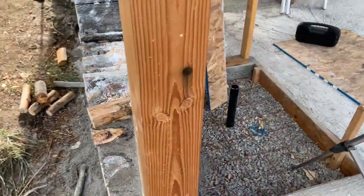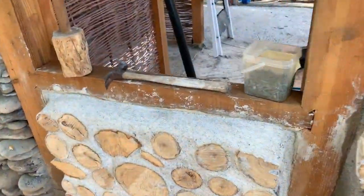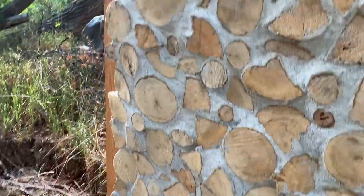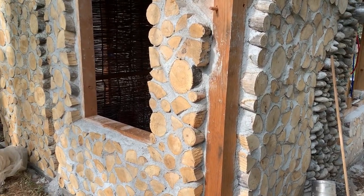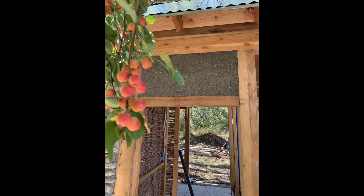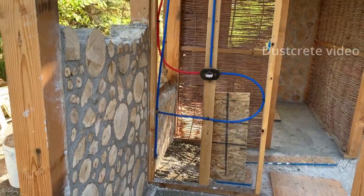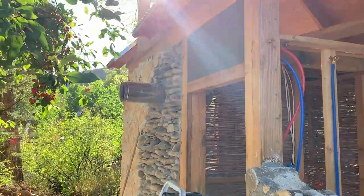There is what we got — all pretty nifty. As your mortar cures up, if you have areas that may be exposed to weather, you definitely want to make sure that they're pitched so they drain. Here's that first dustcrete pour, my test pour. As you can see, it turned out really well. I love the look of the dustcrete, the stone, and the cordwood. Things were starting to come together — it was starting to feel like a house. Hope you guys like seeing this extra footage. Be sure to subscribe if you're not.